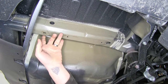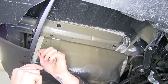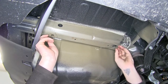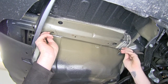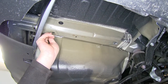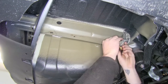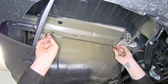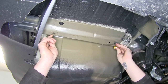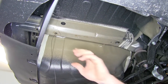We'll grab our fish wire to pull in from the back hole and come out the access hole so we can put in our block and carriage bolt. Bring the coil out the other side, place our block over the coil and into the hole. Then thread on your carriage bolt. Once you have it threaded on, go ahead and insert it into the hole and pull it out the rear most hole.